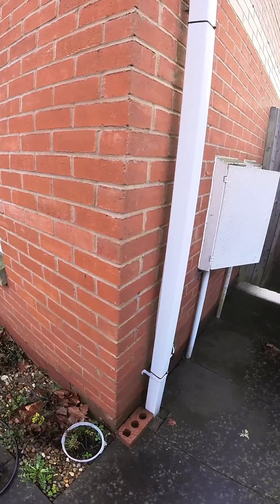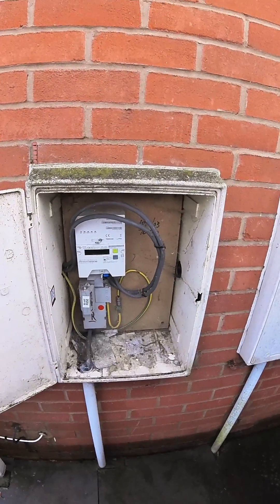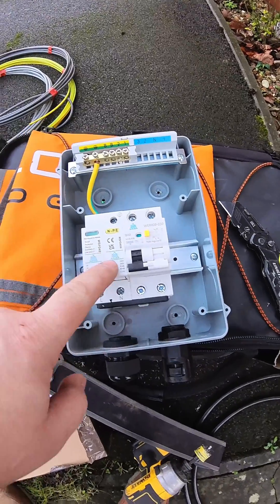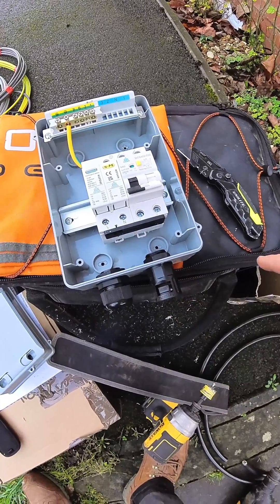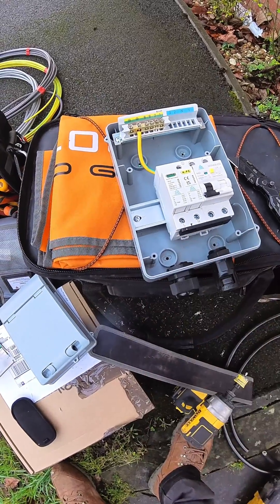There's no short run on this one. We have got some new WCED Henley blocks to try out, so we'll give those a go and see how they are. It's a WCED board again with two-pole surge protection and RCD protection. We're going to flexicon out the bottom to the meter cabinet, with a 25mm stuffing gland going out to the supply cable for the charger itself.